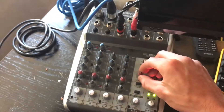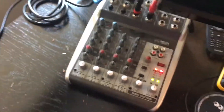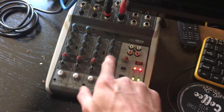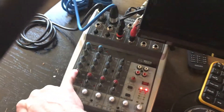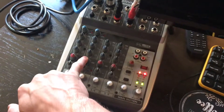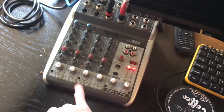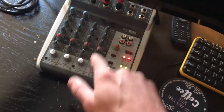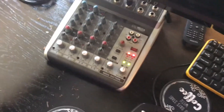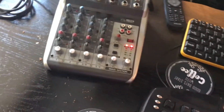The FX Send is controlled by this knob here, which controls the volume. What you have to remember — which I didn't realise for ages — is you have to turn each of the individual channel knobs to where you want them. For example, I have the first mic routed to the stream PC so that's on. The spare mic is currently off so I leave that off. The game audio I leave at full and control it using the normal volume knob. It's quite good — it allows me to use the microphone in two different places at once.